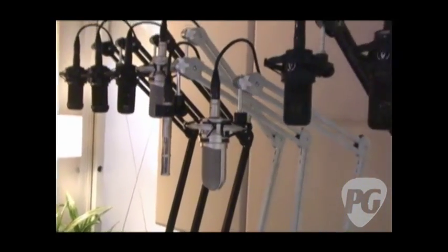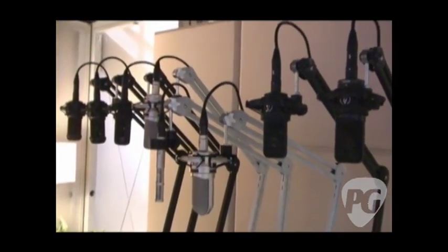Traditionally, ribbon microphones have to be matched with the right preamp. They have very low output. Well, this one uses phantom power and has active output, so you have output similar to that of a condenser microphone, and you can drive your preamps really hard. And you don't have to worry about long cable runs and things of that nature. Again, we stand behind these guys with a 5-year warranty, and we are super pleased to have them in the line.